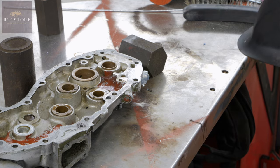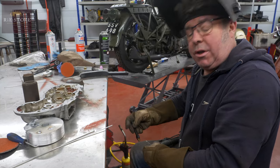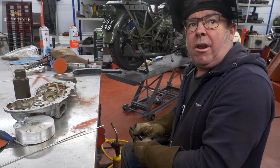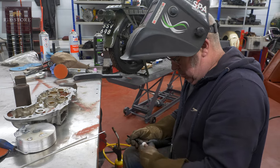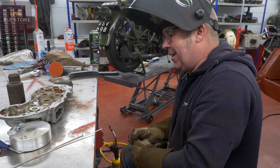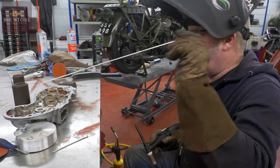Doesn't matter how ugly it looks, because when you're dealing with cast old aluminium the best you can hope for is just laying a bit of weld in there. I'll find a bit of scrap and show you what it should look like when you've got clean metal. Do you create a weld pool? Weld pool first, but because it's cast and you're welding from thick to thin, you've got to get plenty of heat in there and then hopefully it'll all blow in.